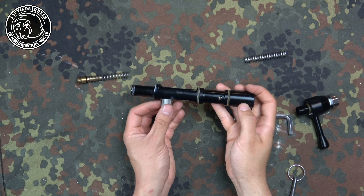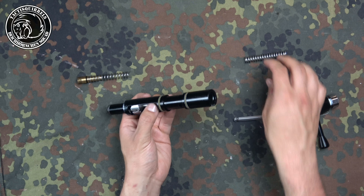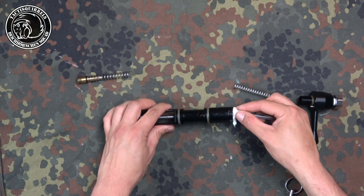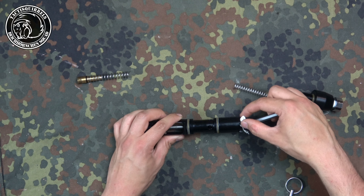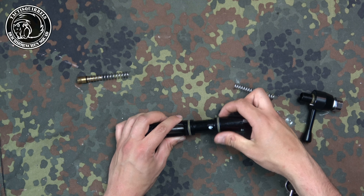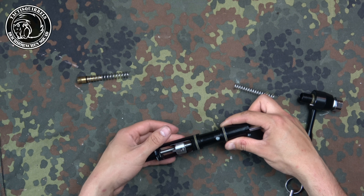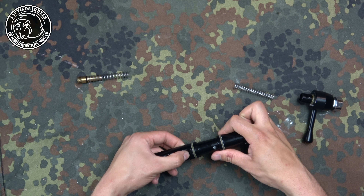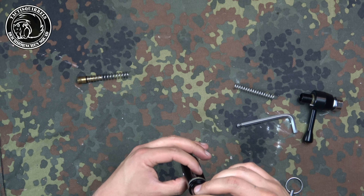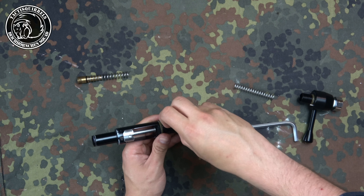Then the hammer — watch out for the right direction. The little catch hook should be facing upside when you insert it this way. Now press the power tube in to avoid damaging the black cap. I use a little tissue paper again and the allen key. There should be two pressure points because of the two o-rings on the valve seat. You need a little bit of force to get it all the way in. You can see here how far it should go.